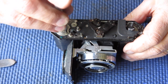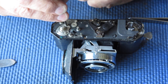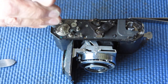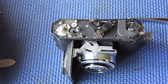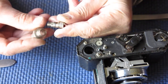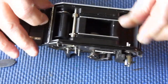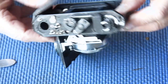Three screws hold the guide bush for the film advance to the body. It's not at all uncommon with old cameras to find the screws are loose; these ones are actually not very loose and are still doing the job well. This should lift out — basically here's our shaft and here's the bush. There's no anti-backup spring or anything on there, just a simple arrangement. At this point we can lift out the film spool, which is a bit dirty and greasy but otherwise unremarkable.